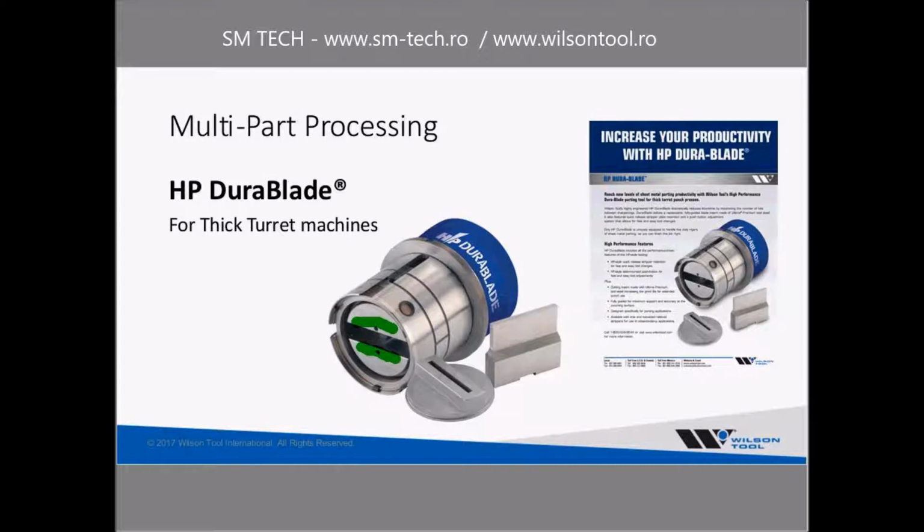You can see the body of the tool has a big slot in it that's made to hold this rectangular shaped punch. And then the body of the punch has this very solid base that slides into the slot in the body of the tool. Holds that punch tip very rigidly. It's real easy to mount and unmount that punch in there.